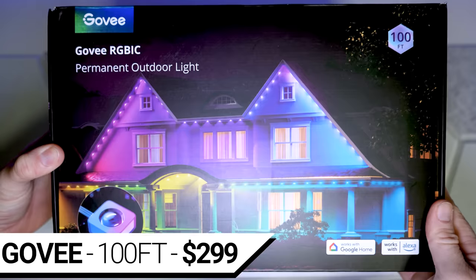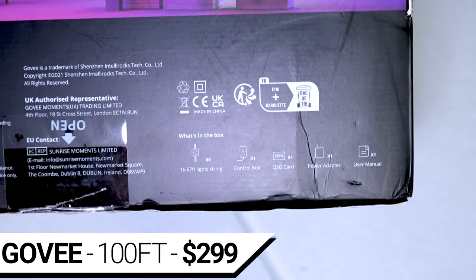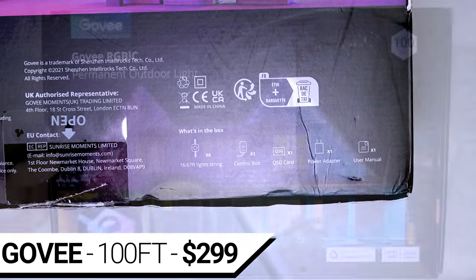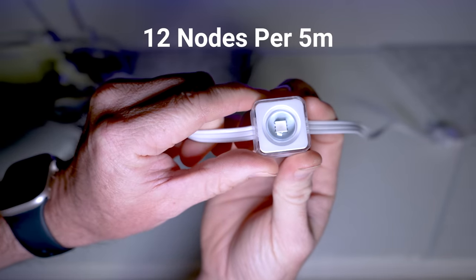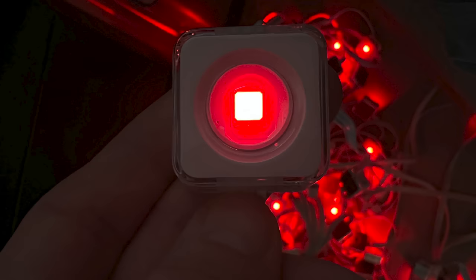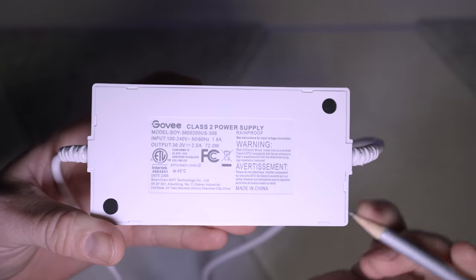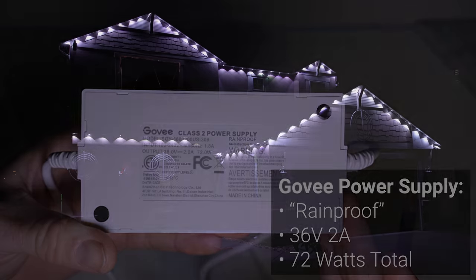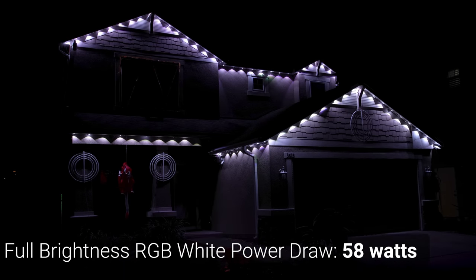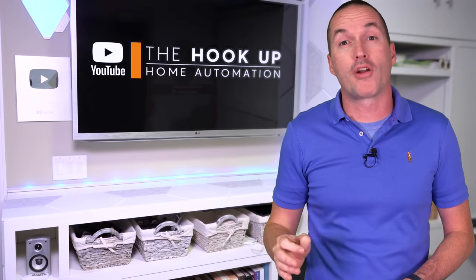Also for $299 are the Govee 100-foot RGBIC Permanent Outdoor Lights. The Govee kit comes with 6 five-meter strings, which can be daisy-chained for a maximum of 150 feet when buying the larger kit or combining kits together. Each 5-meter string has 12 LED nodes with a single RGB LED behind a 30-degree lens, and each 1⅛-inch square node is spaced 15 inches apart. The Govee power supply is wet-rated and provides 36 volts at 2 amps for 72 watts of potential power delivery. On full brightness white, the Govee LEDs drew 58 watts total, which is 80% of the power supply's maximum rating — about perfectly sized to ensure a long lifespan. This 80% maximum power draw is no mistake, and the Govee engineers have done some creative programming to get it there.